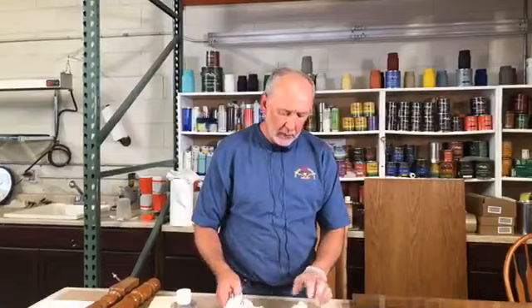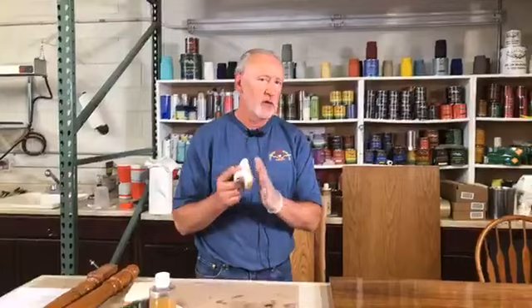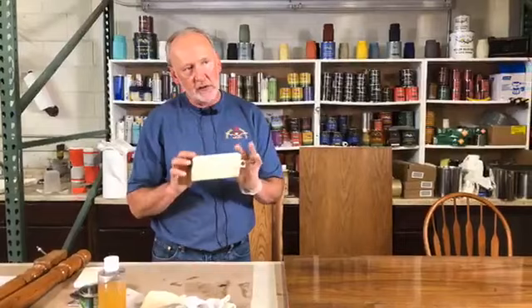This type of application could be used, but I would use the applicator rather than a rag. Before I did, I would wash it really well with soap and water several times to get rid of as much hair as possible. Floor finishers actually use a product like this for finishing floors — bigger pads on a handle — for troweling on stains and finishes. They buy higher quality applicators than you'd find at a home center, and they work fine for applying water-based top coats.